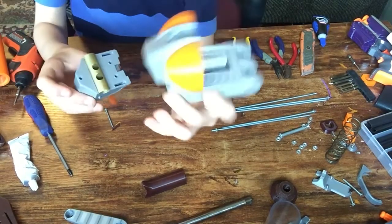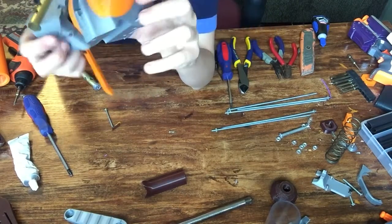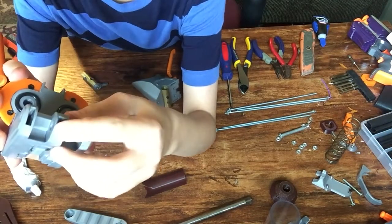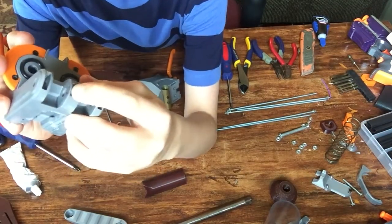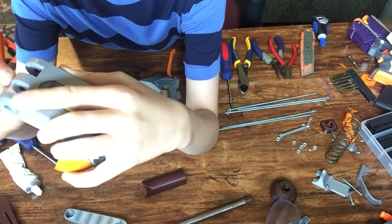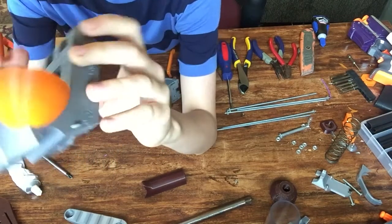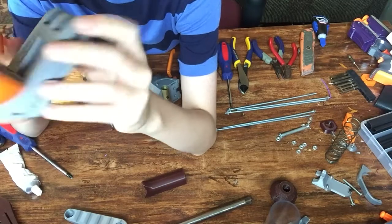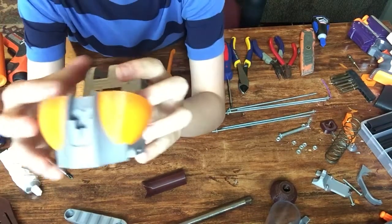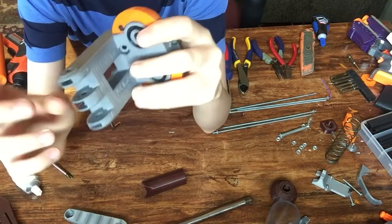Next, you're going to want to take your frame front and frame rear. Yes, I know this is already attached, but I already assembled it, so sue me. So this section, first you're going to put the ejector trip on it. Adrian explains it well in his teardown video, so watch that. Make sure it's facing the right direction with the slanted side down, and make sure the spring is cut properly so that the filament pin can go through easily.